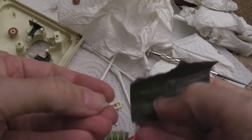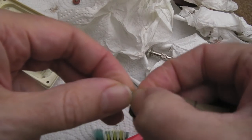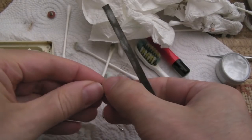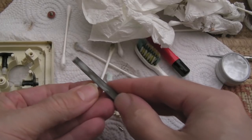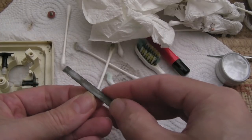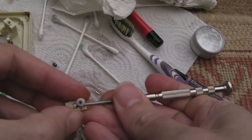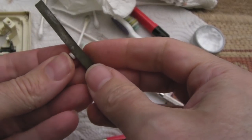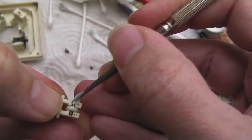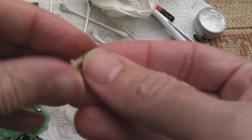I think with this the easiest thing to do is to get a little bit of sandpaper, squish it between the edge like that and rotate it. It's super hard to work on because it's so small. I think the next thing to do is get the file on here and do a bit of this, just try and get a nice smooth surface back. Because there's clearly still a little bit of a rust layer there. It is rotating one way fairly well but not the other, so we just need a bit more. I'll stick some fresh molycote on there in a sec.